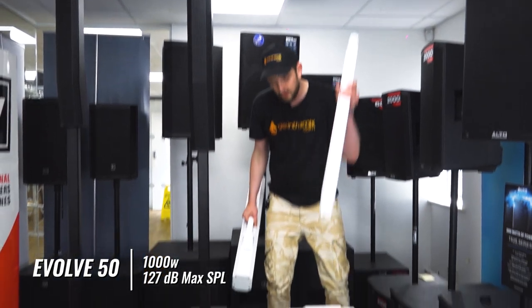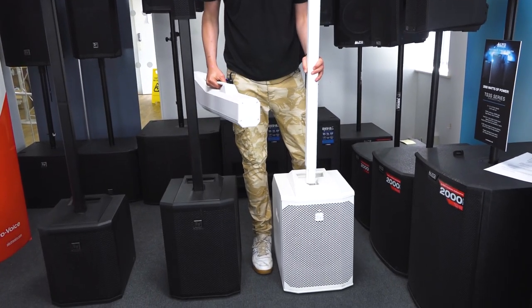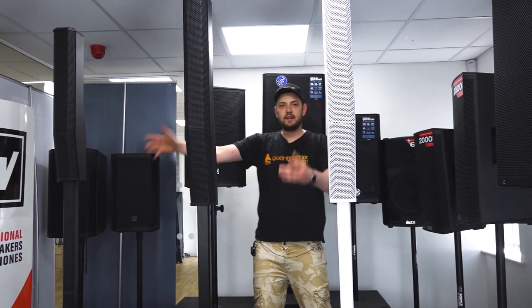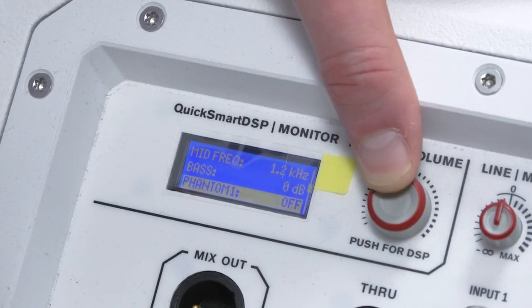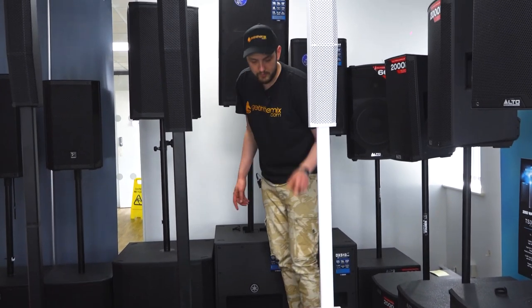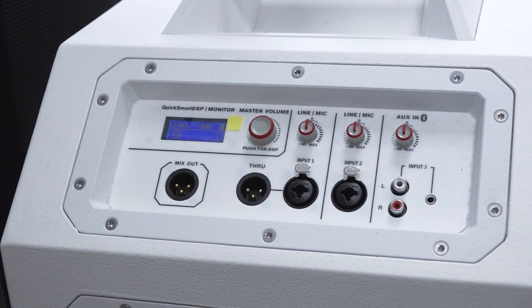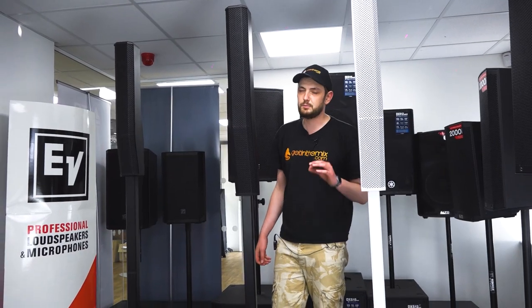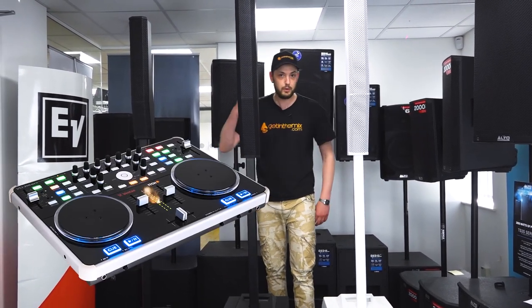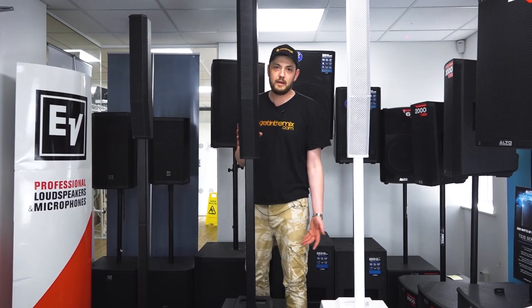Look how easy it is to come apart — that's our audio cable, this is our top, and that's our sub. In one quick movement, we can be in and out of any venue. The same applies for both colours and the younger brother. These units feature the classic DSP LCD monitor, single knob input with two XLR jack combi inputs, an RCA input, and as a bonus, an AUX 3.5mm jack input — perfect for connecting your phone in a last-minute dash to get some music out if your controller's blown up.